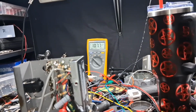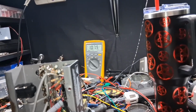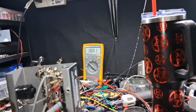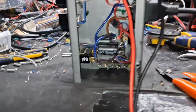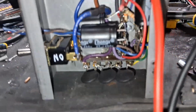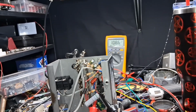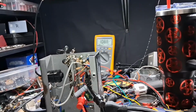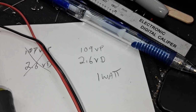That tube has way less than 50,000 ohms of effective resistance, or whatever fancy engineering terms you want to use to describe it. So it takes about 5 minutes for this thing to actually warm up, thanks to these thermistors. Which, yeah, it more than ramps up the voltage slowly, that's for damn sure. I'll come back in about 15 minutes, and if nothing's on fire, I'll figure out what the bias is. Man, that's abysmal. 1 watt of plate dissipation.